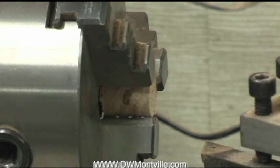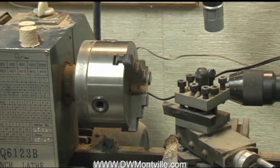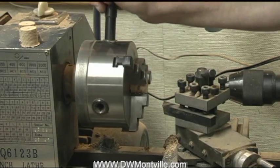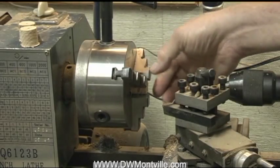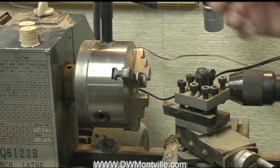What I'll do next is drill the end cap for the hole, then stick a toothpick in both the end cap and the waste block to hold the alignment square, with the toothpick sticking out the bottom of the end cap to engage the hole I showed drilling before. That's what I wanted to show with this video — another means to get a hole drilled straight using a tiny drill like this into a piece of wood.